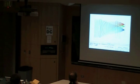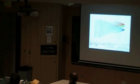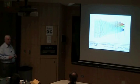On the other hand, if you make the lens the way I'm proposing might be good to think about, there are still two germanium lenses. They've gotten a little bit flatter, a little bit thinner maybe, and this one's the one I molded out of potassium bromide. It's got aspheres on both sides. Germanium lenses with spheres on both sides means you can buy them from anybody who can make camera lenses. I've priced them. It would cost me $30 or less a pair to buy a pair of finished lenses like that made in China. Not half bad compared to what people are charging for these assemblies.